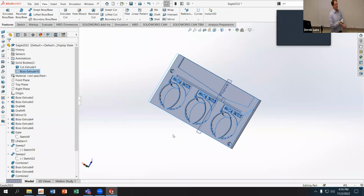Does it have some way of getting the material into that void? So some kind of a gate that's a controlled size. You can be any geometry you want. So the gate can be circular, rectangular, whatever, but you should have some way of controlling the size of the cross section of that gate. It can just be the thickness of the extrude. Some kind of delivery system, so that way you can get the material into the part. Some vents that make sense based off the locations and the directions of your delivery, and then some kind of locating feature. Okay. And this is being recorded, so you can go back and watch that list of things again if you want.